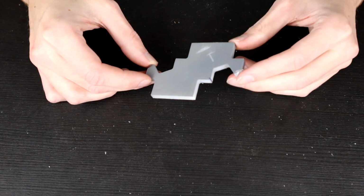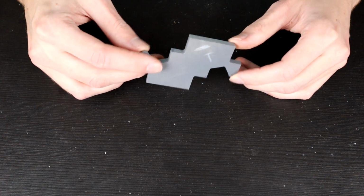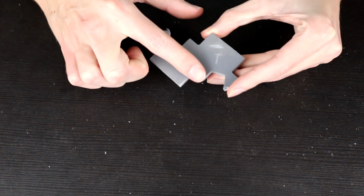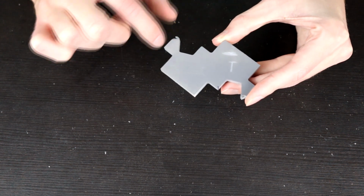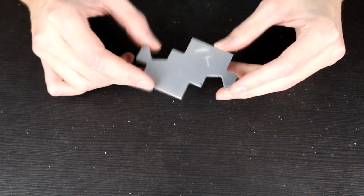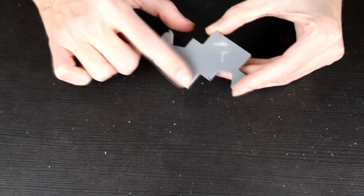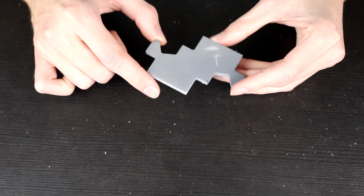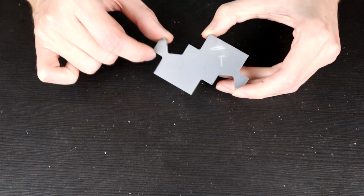I really hope that the change that happens in the HDPE surface comes through in that video, because in real life you can see kind of a glimmer disappear, or like a sheen disappear on the side of the HDPE that you hit with a propane torch. I've tried this with little gas match butane lighter things, and it just does not have the same effect at all. You really do need a propane torch or something similar to do this.